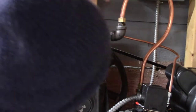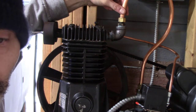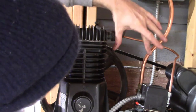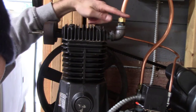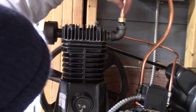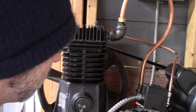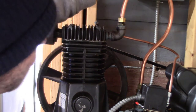I got it all done. I have a little nipple and a half inch black pipe elbow going upward. The thought is that if both compression fittings are pointing up, I don't have to worry about bending one to manipulate the other — the whole piece just drops in. If I ever screw something up, I can cut it off and put a new compression nut on, then just cut the same amount at the bottom and the whole thing drops down a little. This is a much better way of dealing with the transfer tube, and the most reliable way of doing compression fittings on soft copper without screwing it up.